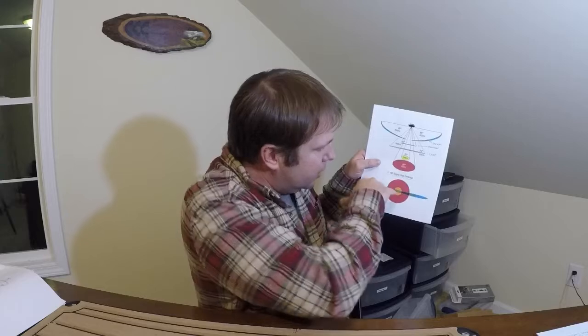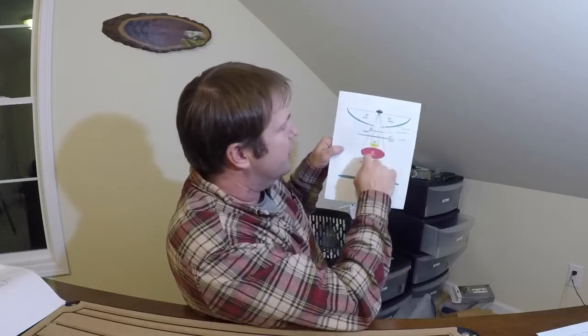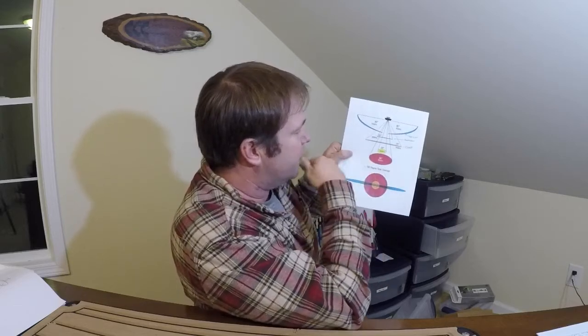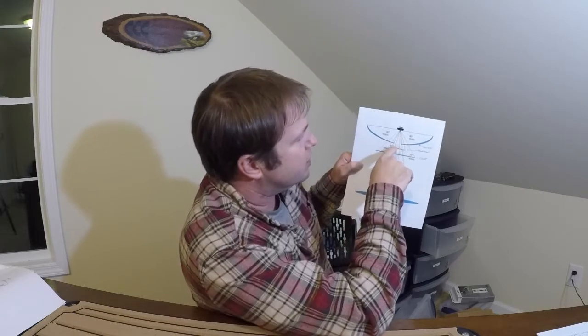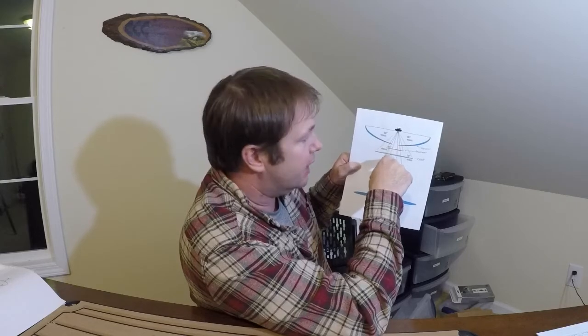On the sonar unit, when we showed the down scan, pretty much take your piece of paper — you can see how I folded it — and basically this is what it's going to look like. You're going to have the line down the middle of your sonar screen, and as you're traveling, it's going to feed from top to bottom. Your water column or depth is going to be in this area right here, and when it touches the bottom, it's going to project down on the bottom. As you get deeper, this blind zone right here gets further and further out, and that's why you've got to be running the down scan at the same time. You'll have different reflections in that column, but it takes a little while to get used to — it's just a whole lot easier to look on the next screen. If something looks funny, look at it on the next screen. That's why I said about 60 feet of water and less, this works real good. Because the expanse of the ocean gets further out, you lose a lot of the intensity of that structure scan or side scan.